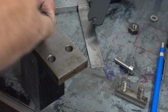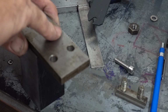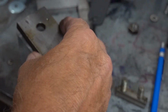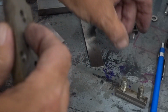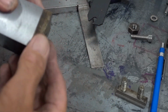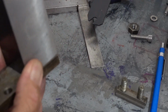Now I can do that various ways. I could use a couple of rolled steel pins to pin it so that it's actually attached, or I could drill that, counterbore it and put something like these in. Well, it wouldn't be them because they're not thick enough. I don't know, there might be. Probably mushroom heads would be better because they're shallower, aren't they?